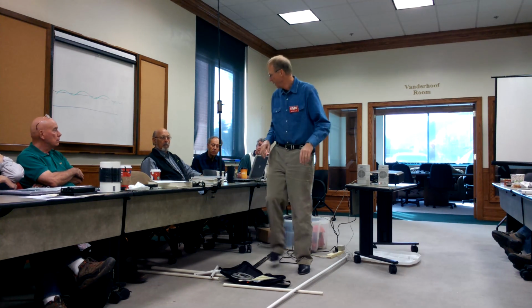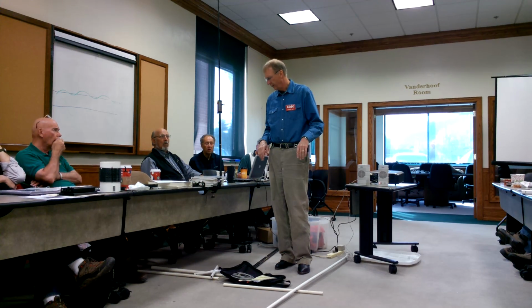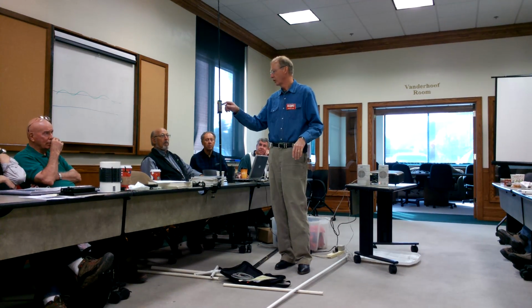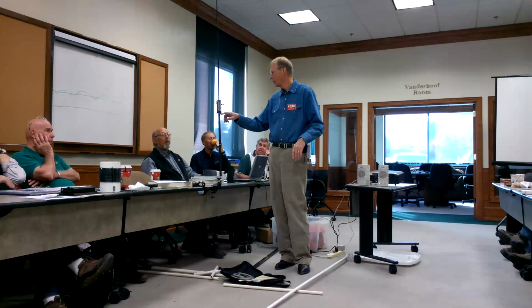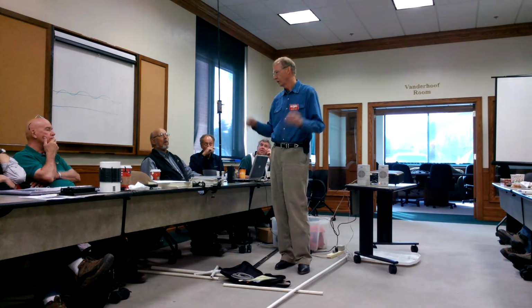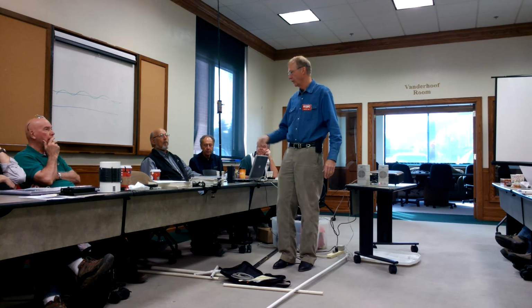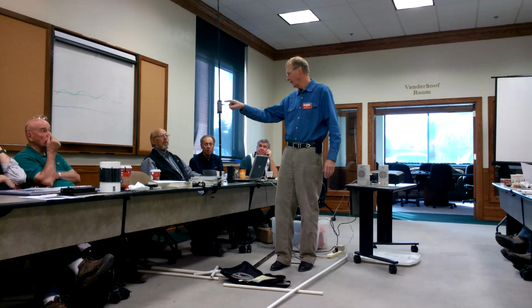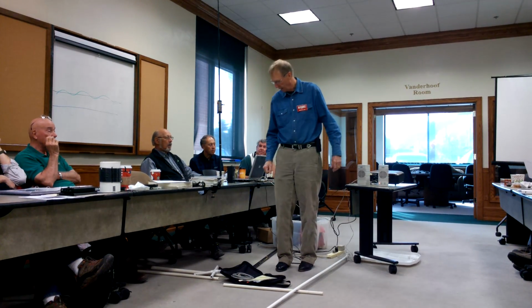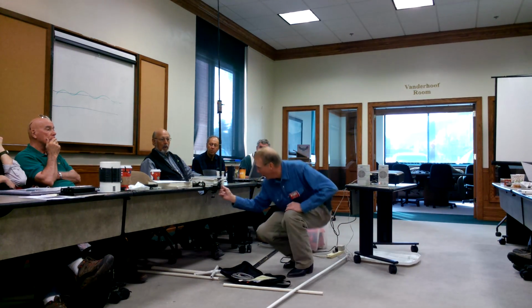How many watts will these do? I think it's 300. Yeah, they're rated for that. If you're not using a coil, which you don't have to use on 10 meters, or if you buy a larger one of these, if you don't have the coil in line, it's full legal limit. The only thing that's rated is when you start to arc this coil. Where'd you make the connections? There's a coax feed right down here.